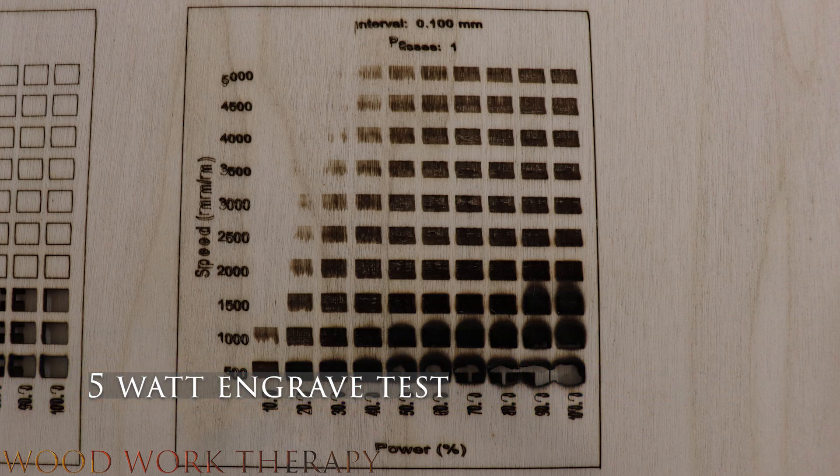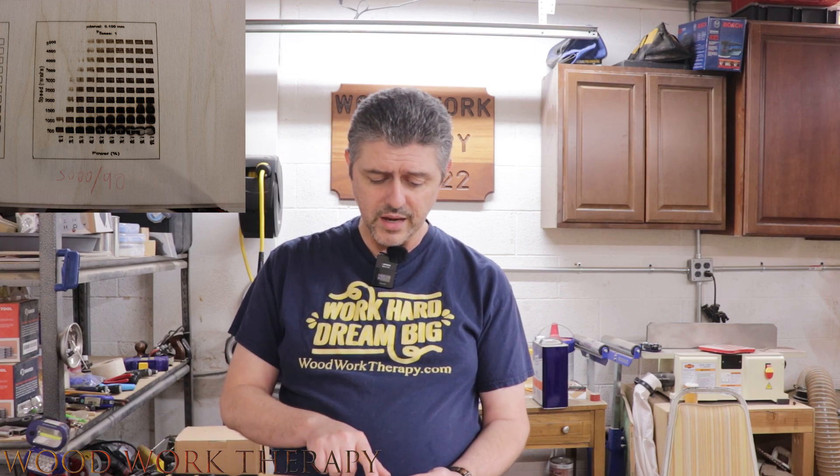When we look at the right side of the card with the grayscale burns, this shows how we'd do a solid engraved object. On the 5-watt, we're able to pull out roughly 5,000 mm/s at 90% power, which is not too bad. I kind of like 5,000 at 100 a little better — it gives a nice light burn. But 90 is probably the best overall because it gives a little more character. If you wanted something bleached out but really fast, 5,000 at 40 would actually do pretty well. So that's just the 5-watt laser.